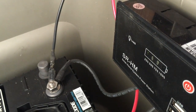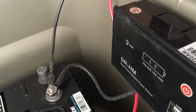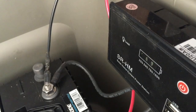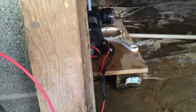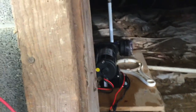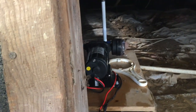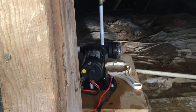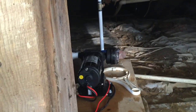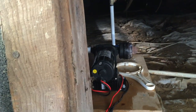The pump only uses about 12 amps and we're putting roughly about 13 into the battery bank, so we're always making more than it's ever going to use — 100% matched on the ratio. The pump is only on whenever needed because it's constant pressure on the diaphragm. It's also variable speed and can move five gallons per minute.